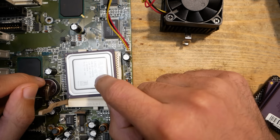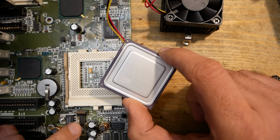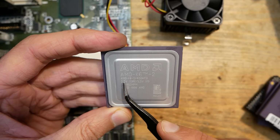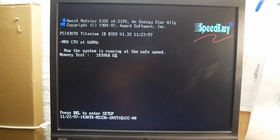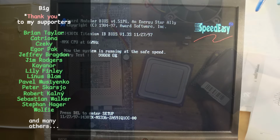This board doesn't know any Super Socket 7 CPUs like the AMD K6-2, and since the BIOS is not quite standard, it is a bit more complicated to add that support. Especially the required lower voltage down to 2.2 volts is not possible out of the box. Of course, I tried to run an AMD K6-2 briefly to see how the board would react, but it couldn't detect the CPU properly. It rebooted every time as I was trying to enter the BIOS and applied 2.8 volt core voltage instead of 2.2 volts. For a short time the CPU would survive it, but it's not healthy in the long term. It would be really nice to add AMD K6-2 support to this system, but maybe this is a topic for another day.